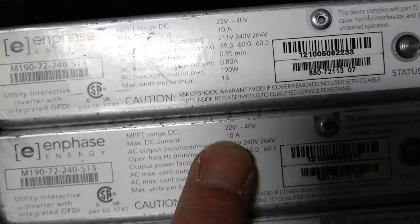Now 22 to 40 volts is the MPPT range, but that's not the full operating range. Their maximum range is actually from 22 volts to 54 volts, and that's what is interesting — because if you want to use these with a 48-volt battery, it can work as long as you keep your battery below 54 volts.